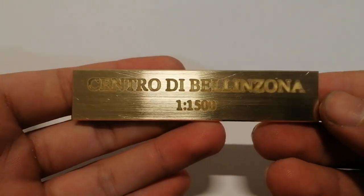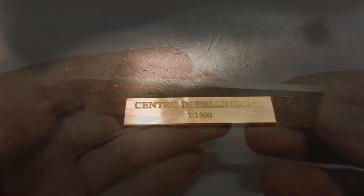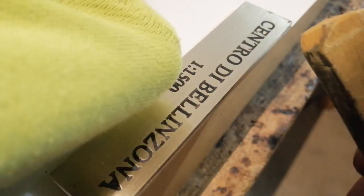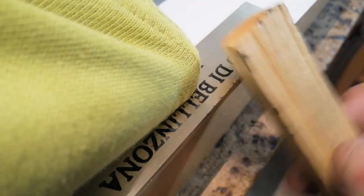Because I want to have the letters black instead of a dull brass color, I'm going to spray paint it again on the top and then sand it off. I put some chamfers on it and polished those while leaving a sanded finish on the front — I think this combination looks pretty nice.